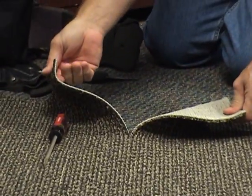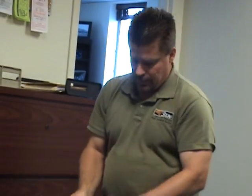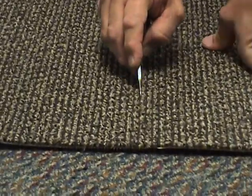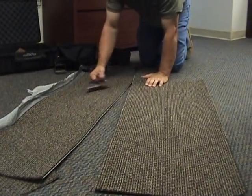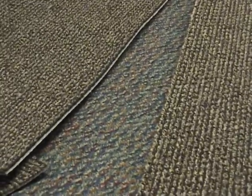But when we cut it, see, we're not cutting any yarn fiber. If we're doing it, we always like to cut between the dark and the beige. The reason for that is when you're putting them back, you've got that dark dominant brown and then the light beige, and that's going to go back pattern-wise. They'll just row cut it down the length of the carpet, and you can look at it. There's no fray. Actually, I can cut some out and show you. Can you guys see the dark side and the light side that he's talking about?